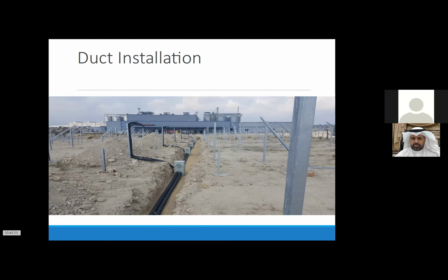But when we talk about high frequency noise, or touch voltage from the frame, from the modules, it has to be below 1 ohm. So an earth rod, whether AC or DC, above 1 ohm is completely useless. It's not working. I don't know if you remember, Salem, when we did the tests in Kuwait with the existing structure, and we doubled up the earth, and what leakage current happened when we doubled it up, although it was earthed already.